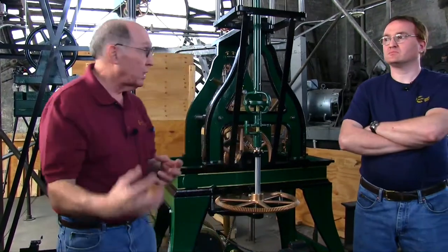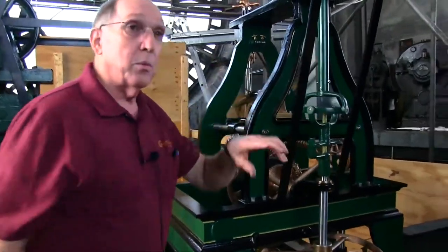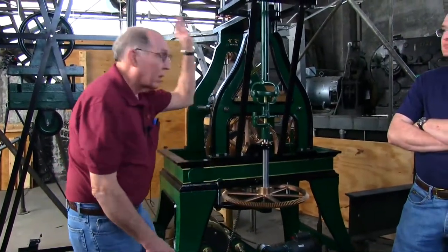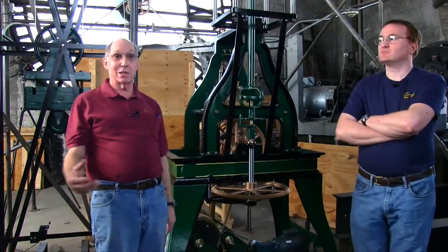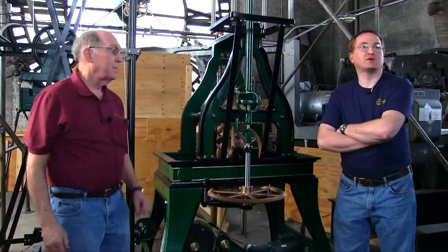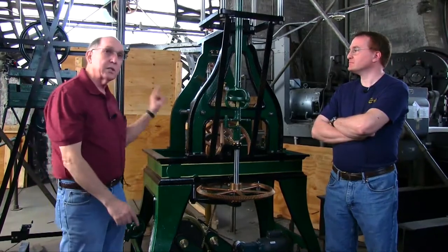If the clock was electric, as it was before, what it would do is drive the physical clock — driving the hands and all that. But once something seized, like a bad bearing or iced hands, that electric motor — nobody said slow down, I'm going to stop. It kept going and started destroying pieces all the way up and about. It had too much torque, because the power to power consumption is no longer balanced. Electric motors kill these clocks. Big time.